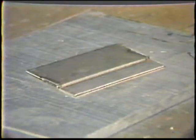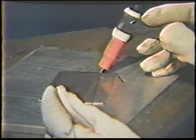This part of the job practice will use the same kind of workpiece as before; however, filler metal will be used to form the weld. Prepare a lap joint and position it for welding. Again, use a 70 degree work angle and a 10 degree push travel angle. Place the filler rod in the joint and angle it 20 degrees from the surface of each plate. Start the arc and direct the electrode at the root of the joint. Use the lay wire technique — hold the filler rod stationary at the root of the joint and completely fuse the filler metal into the root and sides of the joint.